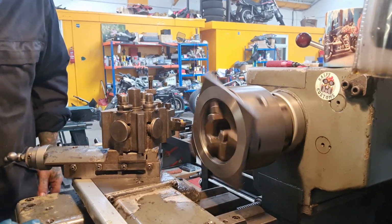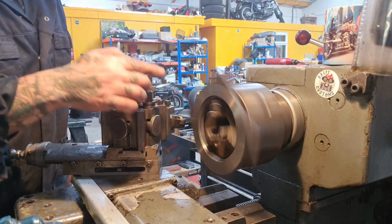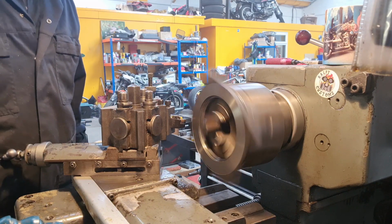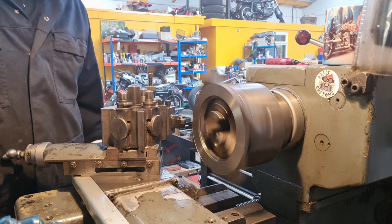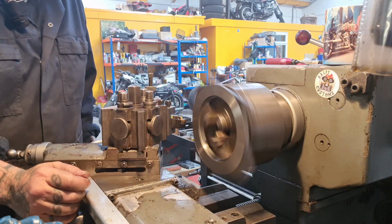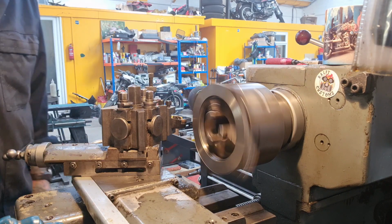So a quick tap, tap, tap. I might increase the speed actually, as I machine this to round now. That's where it's going to be round. It's going to be 157 I've worked out, OD, thereabouts. And then it just needs some holes drilling in it, I think. I don't know if I'm going to take it to the milling machine and shape it. We'll see. But I thought I'd finish off this bit with a dinkety. Oh, why not?